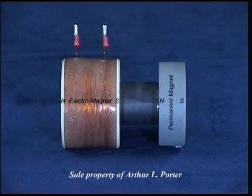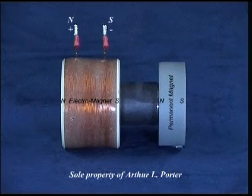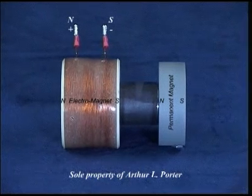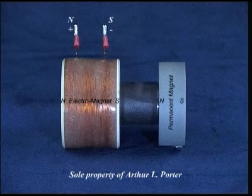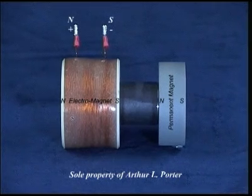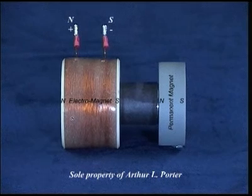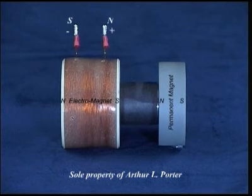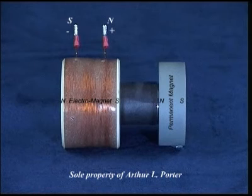When DC voltage is applied to the electromagnet, the strength of the combined magnetic forces can then be measured. It will result in an amplification of the magnetism, in this case about 1.6 times the force of the permanent magnet alone. All that's needed to neutralize the magnetism is to simply reverse the polarity of the electromagnet. The total magnetic force will be near to zero.